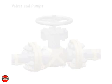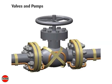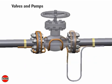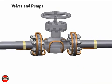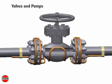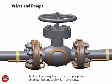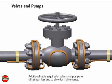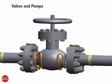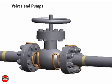For installation on valves and pumps, install heating cable utilizing a looping technique. This allows the valve or pump to be removed if required. Crossing constant watt heating cable over itself should be avoided. Do not exceed the heating cable minimum bend radius of 10 millimeters or 3/8 of an inch. The valve allowance is the total amount of additional cable to be installed on the valve. If multiple tracers are used, the total allowance may be divided among the individual tracers. The total valve allowance may be alternated among tracers for multiple valves in the heat-trace circuit.